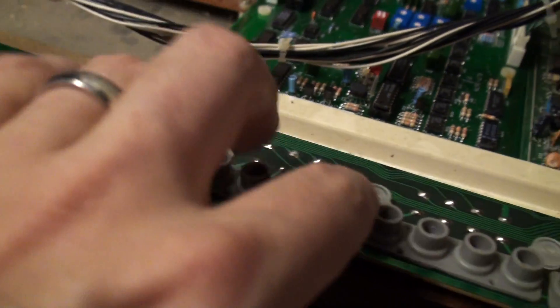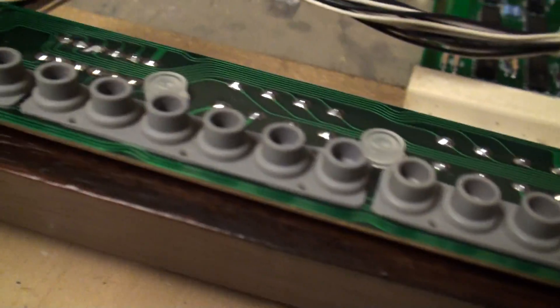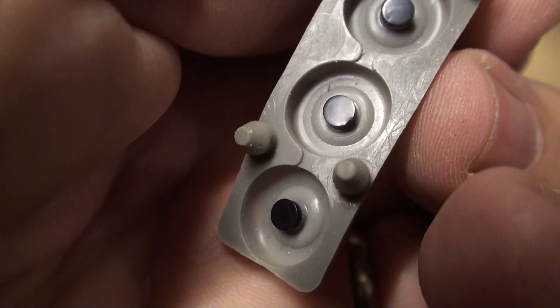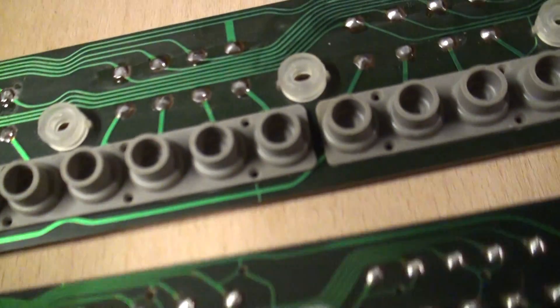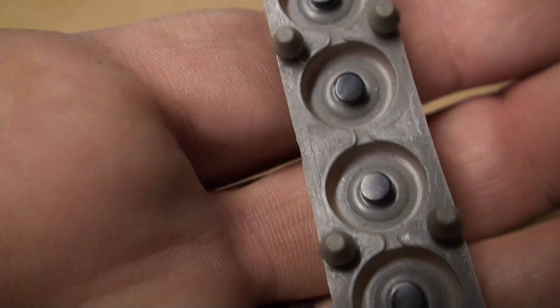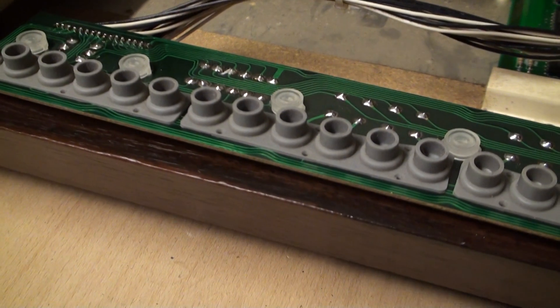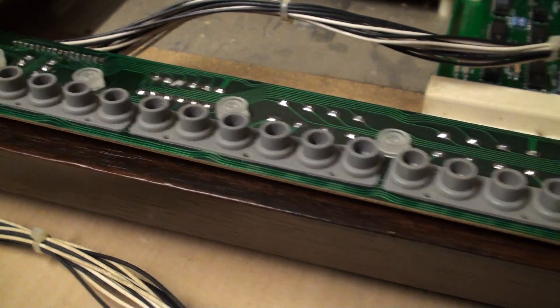The jury's in on this one: I'm getting better results from the silver pen than from the black contact adhesive discs. They don't look incorrectly mounted. I'm trying to work out if it was a mistake on my part, but I think it's just that if you get a little bit of grease on these discs they cease to be conductive - they're prone to being fouled easily. The silver pen, not so much apparently.